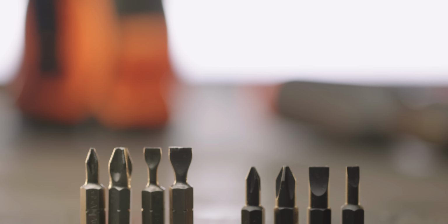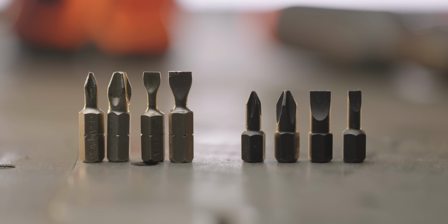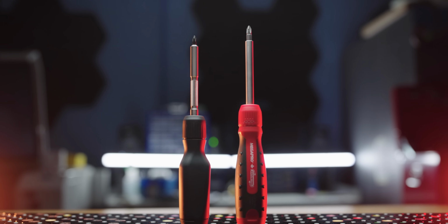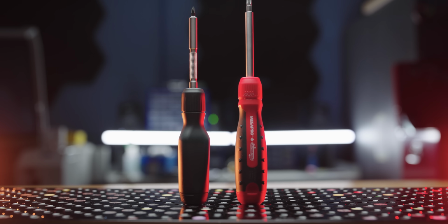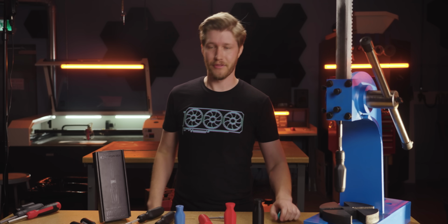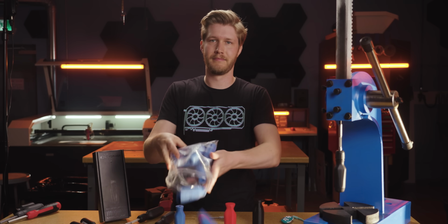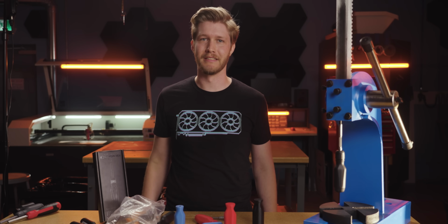What we were willing to give up though was the length of the bits. By reducing them from 25mm to 20, and making a couple alterations to the zinc housing, we were able to make our handle nearly an inch shorter than Mega Pro's and create a handle that is awesome to use no matter your hand size. 2 versions later, we arrived at version 7, which is the handle design you can buy now. I did create versions 8 through 20, but all of them are worse than number 7. So 7 it is.